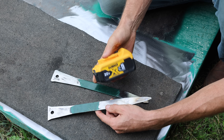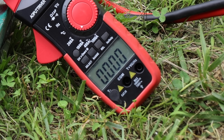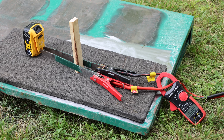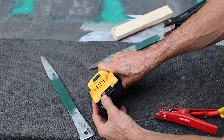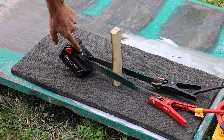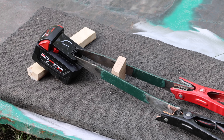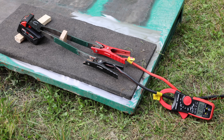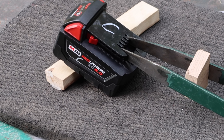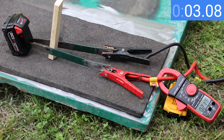Let's test the batteries for short-circuit protection. The batteries are fully charged, with two metal conductors attached to the positive and negative contacts, and a current meter to measure the energy spike. The counterfeit DeWalt made it to 248 amps, let out a puff of smoke, and showed no signs of life. The genuine DeWalt had a voltage spike to 290 amps for less than a second and immediately powered down. The counterfeit Milwaukee spiked to 217 amps and let out a puff of smoke. A second counterfeit Milwaukee made it to 193 amps, powered down suddenly, and blew a spark out of the bottom of the battery case. The genuine Milwaukee made it to 277 amps but did not power down — it tried to power through the dead short for almost 14 seconds, which doesn't seem like good overload protection, though the battery did not catch on fire.